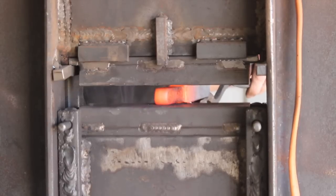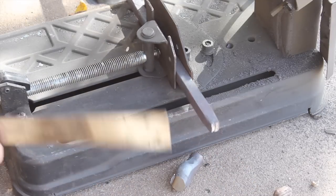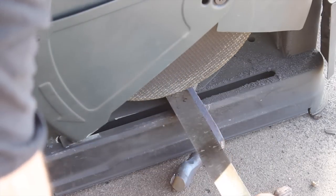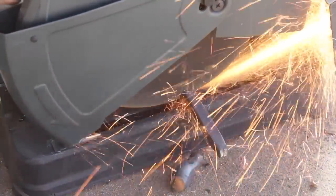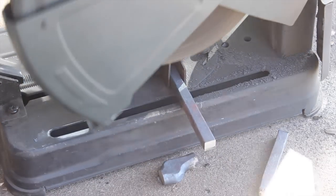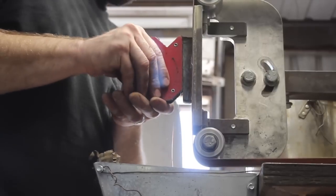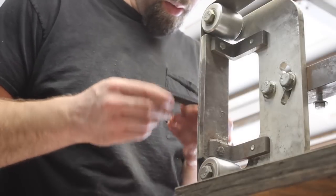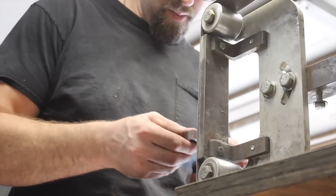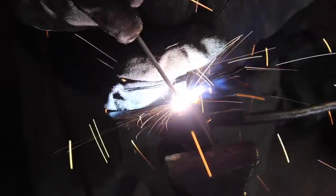I actually kind of forgot what I was doing when I forged this down. I wanted to make the ratio of the steels such that in the finished blade the power core would be more prominent. To do that I should have forged the Damascus about one inch wide and a half inch thick and set it into a square bar of half inch like I did the outside pieces. This is only the second time I've done this power core technique. The first one was on a little Puuko style blade where we used cable Damascus as the power core. I learned a lot from that and it's still going to turn out really cool, just experimenting with the ratio of steels for the desired finished product.